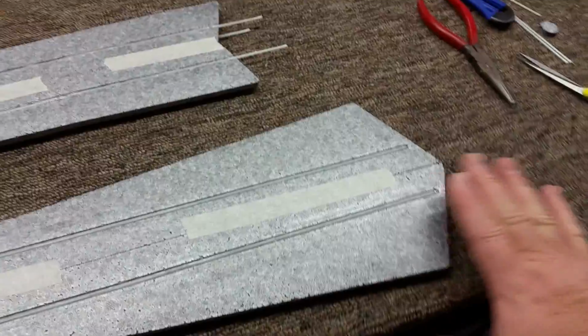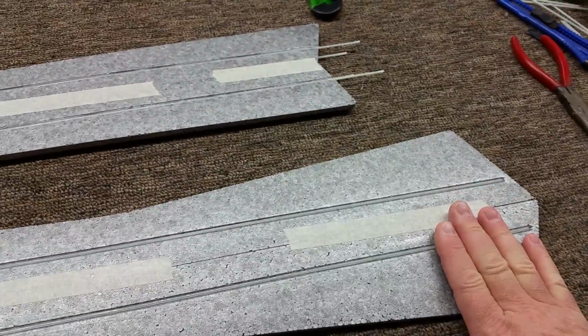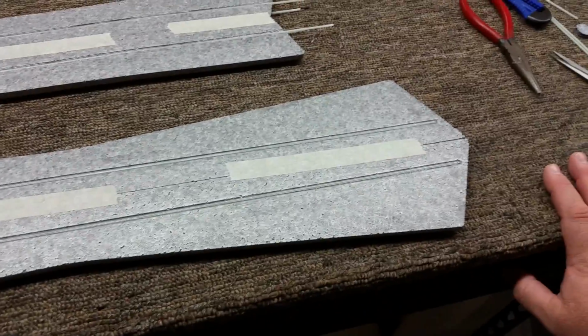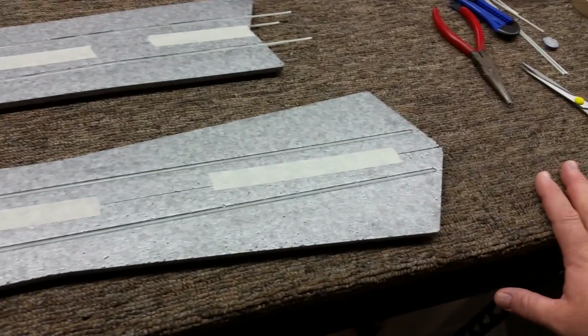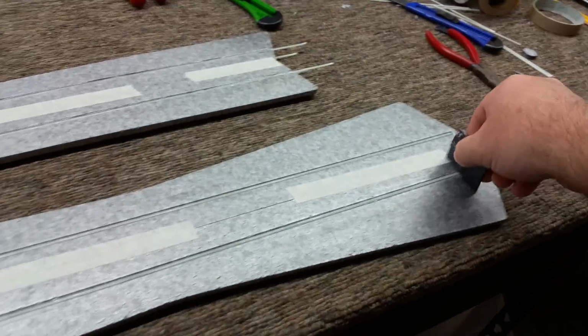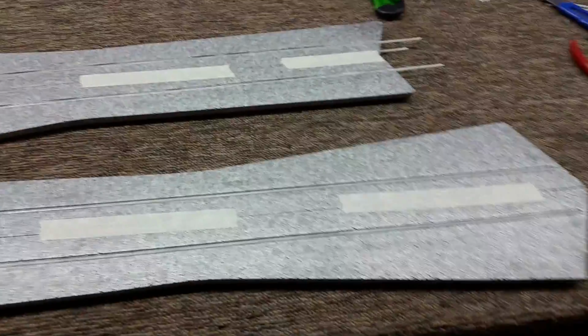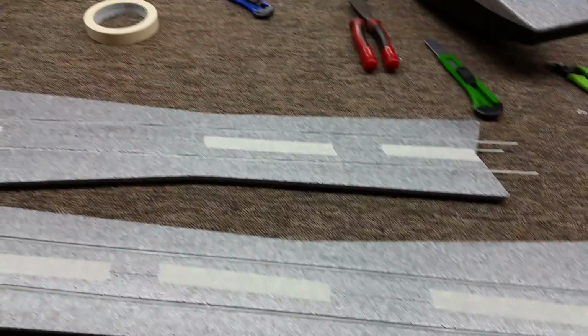What this does is it allows a laminating film to stick to the hot glue really, really well, and it helps tie the surface tension of this laminating film across this EPP, which is going to make it very, very stiff. After you hot glue it and you get this dragged across here and pull off the excess hot glue by wiping it off, then we're going to go ahead and paint it. So I'll go over that process after this.